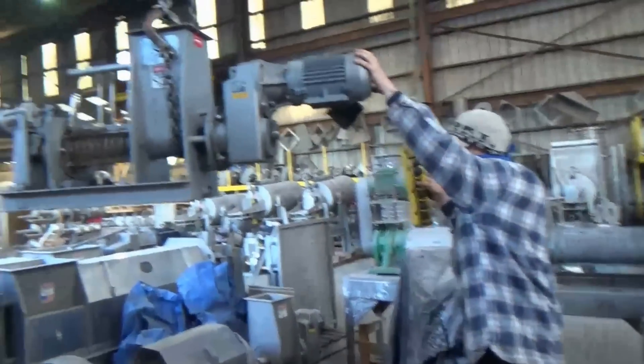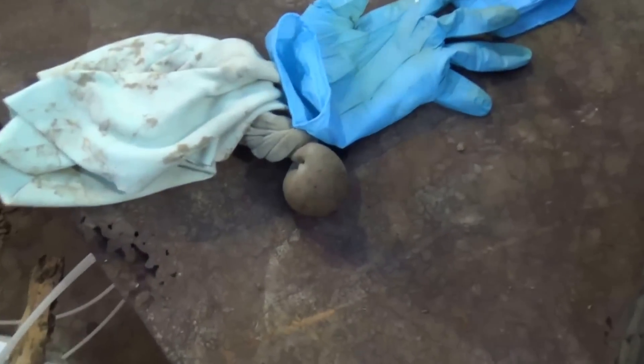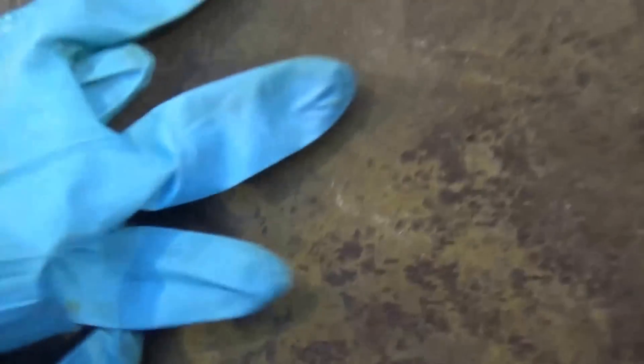It's the next morning and this press is leaving — due to be shipped next week. I should have run this test at the beginning of yesterday. I pushed it as hard as I can, very very tight, and got just a little water out. On my gloves you can see a little bit of water, maybe. This was fresh manure out of the bucket. There's no free water in this material. We got the plug wet, but this manure did not have water in it to be removed.